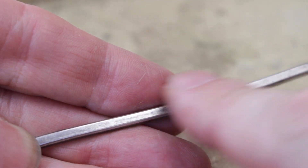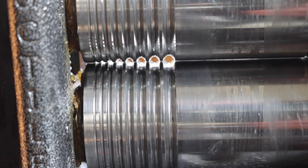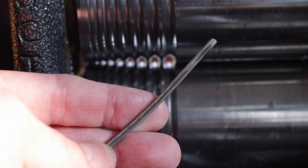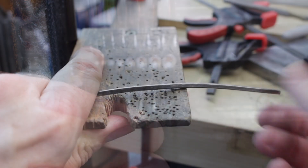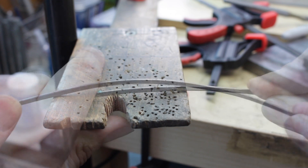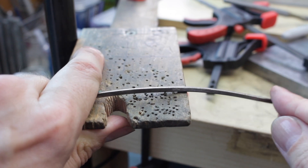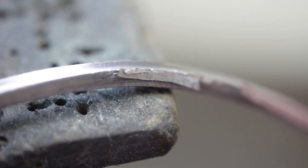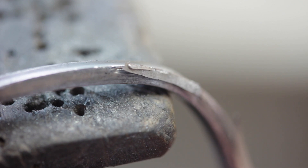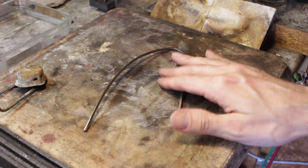This larger piece has been annealed several times in between each groove on the rolling mill, so it doesn't splinter or crack. But even so, just with the last few passes through the mill it's gone hard again — it's very tough to bend and you can see how springy it is. The metal is perfectly fine, but it's just too hard to use. If I continue to roll it, it will crack and splinter just like the other piece.